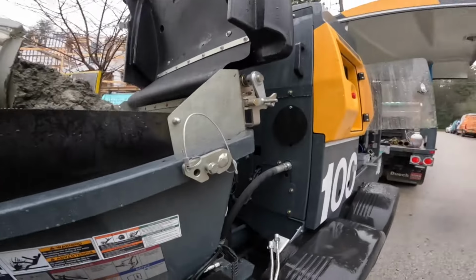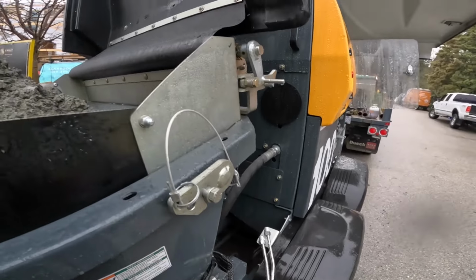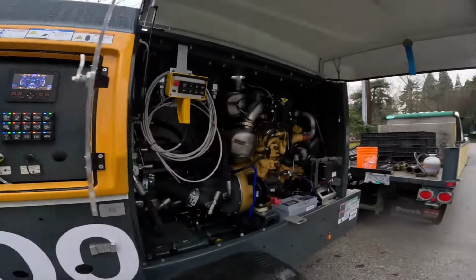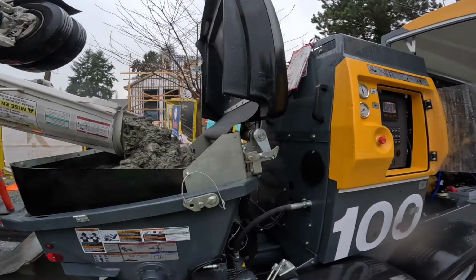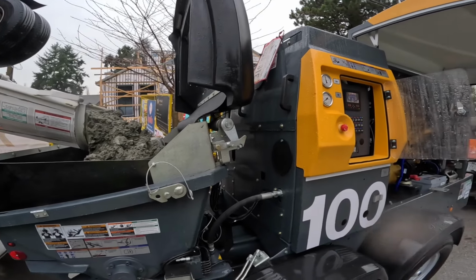Me personally, I like having the individual grease nipples, and I can put my gun on it and I can feel and check if each one is getting greased or not. But yeah, definitely some advantage to an auto greaser. For a pump that didn't do SHOTCRETE, I would probably just opt for manual greasing. But for something that's doing SHOTCRETE all the time, 100% I'd take it.